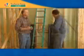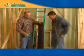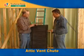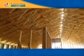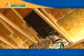As I just came in, you were working with one of these. What is this? This is a vent chute. There are a lot of different styles, but this is the one that sells the most around here. By code, we have to get some attic ventilation from the soffit at the overhang all the way to the peak. When we have a vaulted ceiling like this, sometimes it's a little tough. So what we have to do is put a vent chute up between the rafters. We go every other bay, and the bottom edge sticks out past the exterior of the wall. Then this will go all the way up to about where there's two feet of insulation in the attic, and then it'll stop.